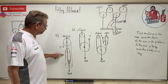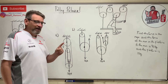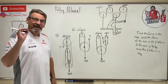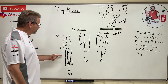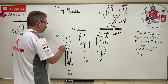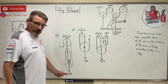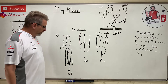We're going to start here. You've got to draw some free body diagrams. We're going to try and figure out what ropes we have to cut to let the pulleys hit the floor — but you can't cut through more than one rope at a time. So let's look at this first system. How many ropes are in this system? Let's follow it — it's one rope. Where do I cut to make that pulley hit the floor?